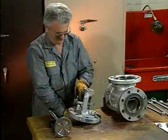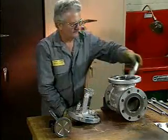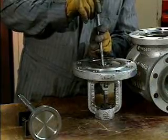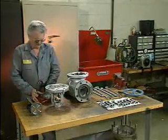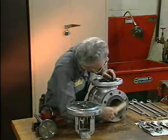The mechanic extracts the gland nuts and bolts, and now that the stem is removed, takes the gland follower completely off. Finally, he pushes out the old packing. Once a valve is disassembled, its exposed parts can be inspected thoroughly. The mechanic in our example begins the inspection at the flanges.